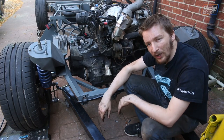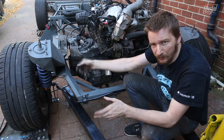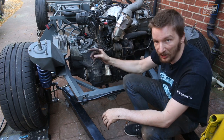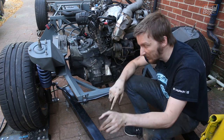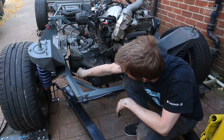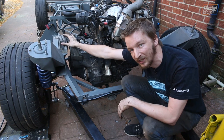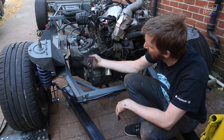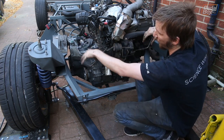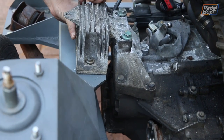Small snag here that we've already corrected for in our old engine. These motor mounts up at the top have a fair bit of room for adjustment on them, I'm guessing maybe to compensate for chassis differences and stuff. Now, this engine and transmission is sitting a lot further left on its mounts in the TT than ours was, because we'd already adjusted it to make this work. And what that's caused, the transmission and our lower chassis arm here are right in contact and we're nowhere near correct installation position. So we're gonna loosen this all up, see if we can move the engine kind of rightwards in the mounts, and then bolt it all back together and see if it all fits, or if we're going to have to notch that lower arm, which will be great fun.